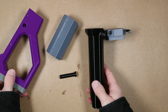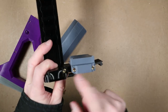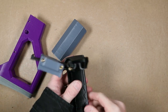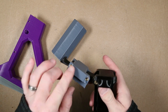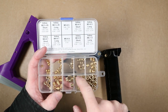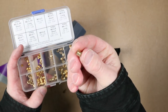There's a lot of parts that are well thought out. There's a couple of changes I'll get into a little bit later. I wanted to show you the completion of the process putting this together because there's some heat set inserts that go into this, and all the holes instead of threading in the plastic he'd done with that. So if you look at the bottom here, we've got three — these are M5 screws, M5 by 40 millimeter, and there's three of them. The heat inserts I would use are these M5 ones.